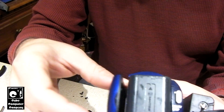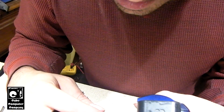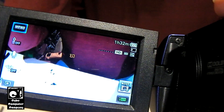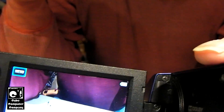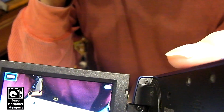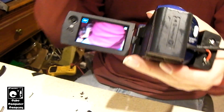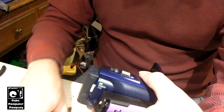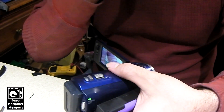We have 18650 modded this camera, so it's no longer going to be sitting on my shelf not getting used because of the battery. I can use my 18650s to power this thing. The camera estimates an hour and 23 minutes on the battery — and I'm pretty sure after a cycle that's going to go up significantly, because that estimate was based on the stock 500 mAh batteries and here we're running 2200 mAh cells. So this thing probably has some really good run time.